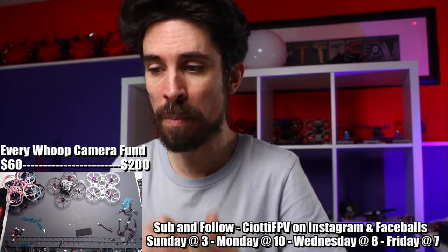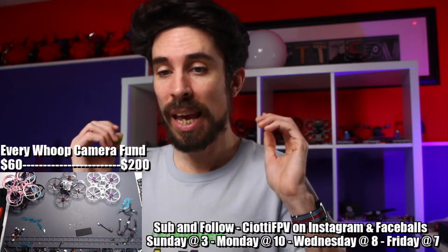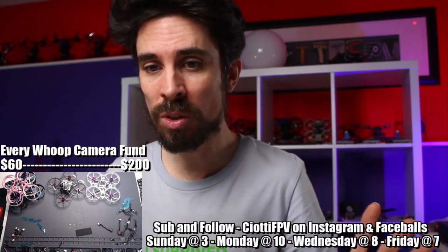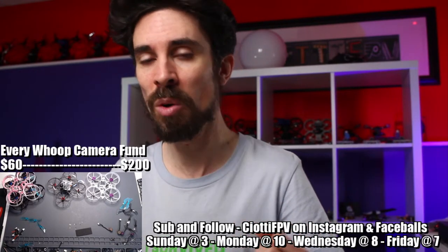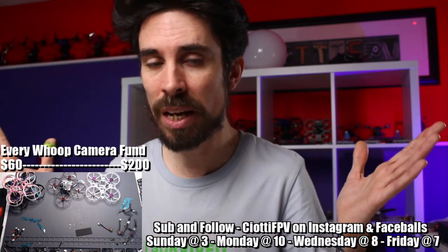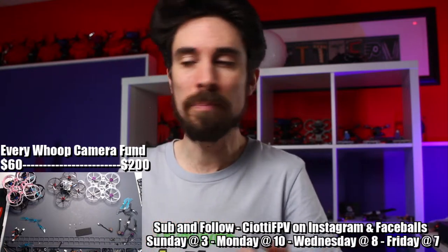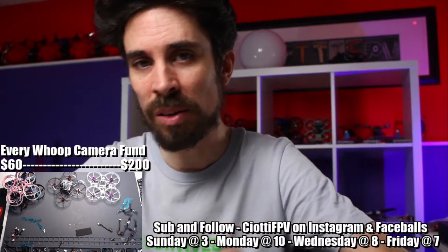And again, the biggest problem is the psychological aspect of it. If you've got a rig where in one second you can unplug and plug in a new motor, you are always going to run that rig cleaner than a rig that you have to direct solder 30 gauge motor wires. And Tiny Whoop motors are like $8 or $9 each. You'll have extras typically, and it's, oh, I banged this one up, done, unscrew it, unplug it, swap it, good to go. No big deal. Your rig is now clean again.